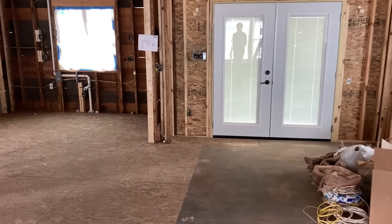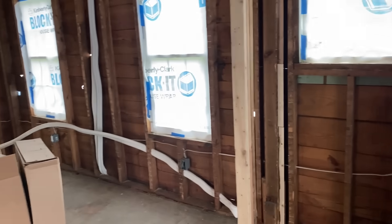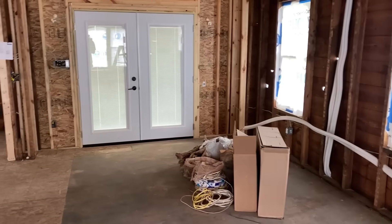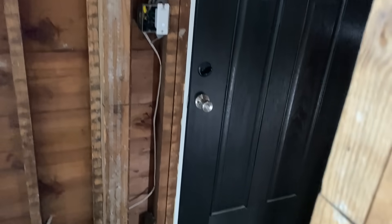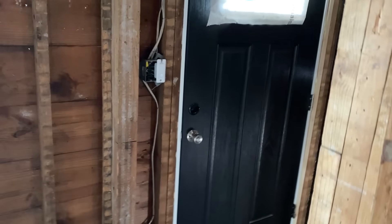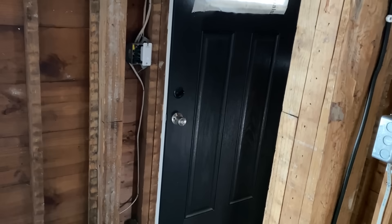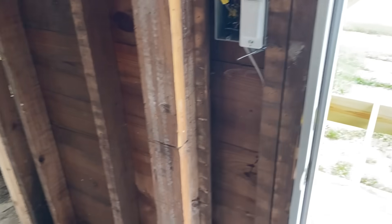For the future, I would run a 20-amp in the entire dining room area — apparently that is code now. In the living room, everything was fine. The only issue was that I hadn't put an outdoor receptacle in the front — only in the back. It is code to have one in both the front and the back. I'm not even sure why I hadn't put one in the front. He asked that I add a receptacle out front.